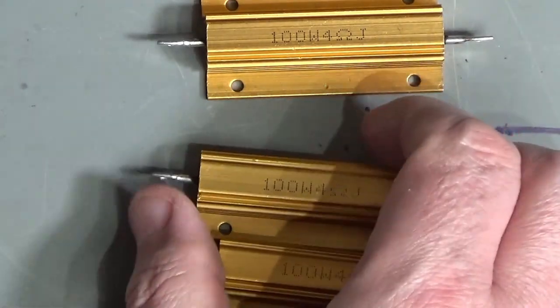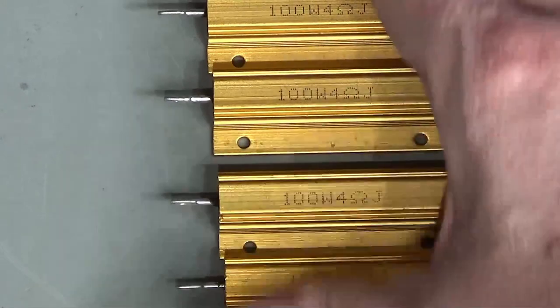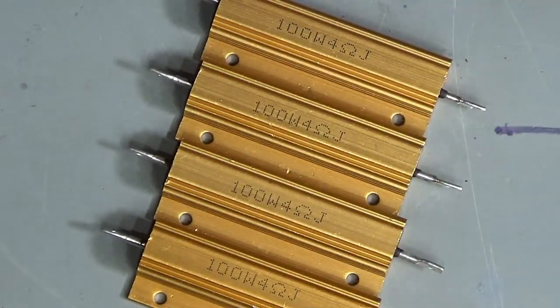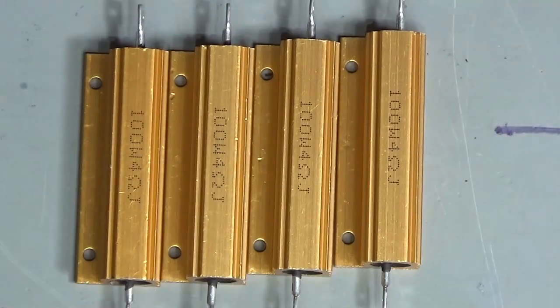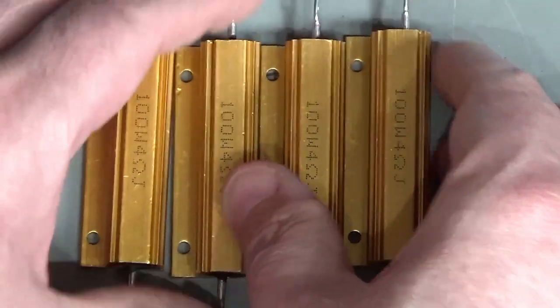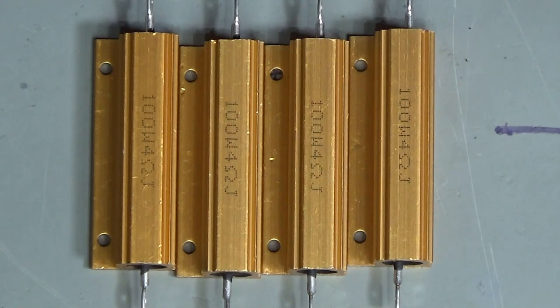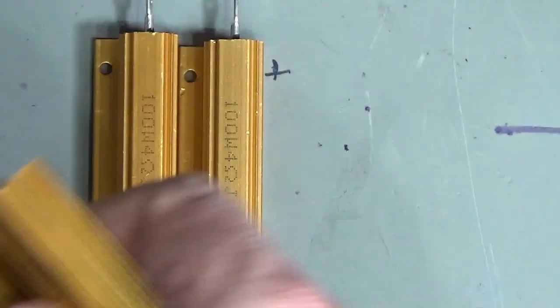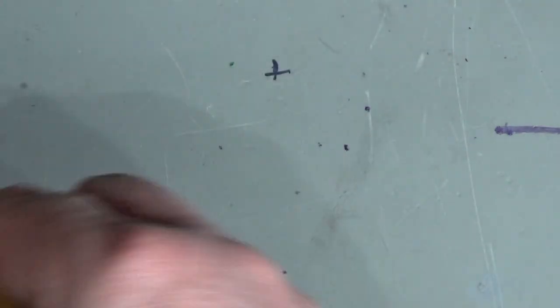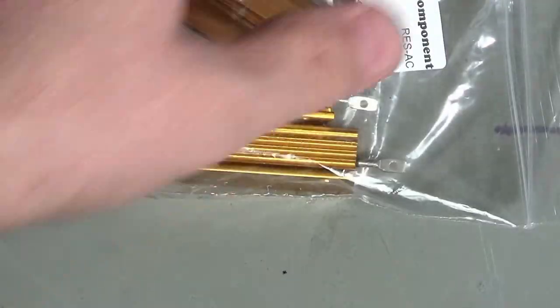I did think about putting more resistors in there but they're expensive enough that you don't really want to buy a whole load of them. These will go in a box, mounted on a heatsink with a thermally activated fan. It'll be a very simple little build but quite effective. To simulate a loudspeaker I might also put a little inductive, low-resistance winding in front, just to get a slightly more speaker-like characteristic.